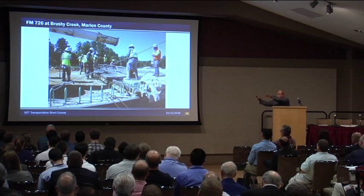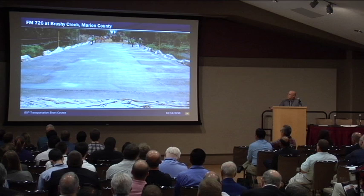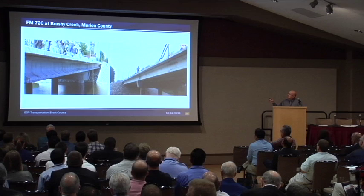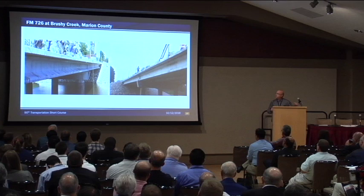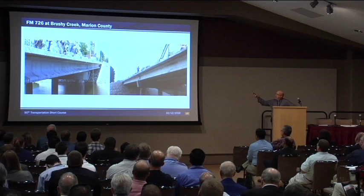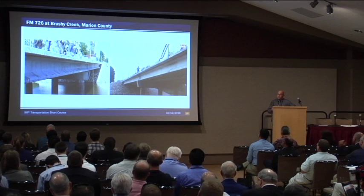This is the finish after the brush with the curing compound. As you can see, no leaks, no blowouts — the foam worked really well. We required pencil vibrators instead of the normal vibratory units to consolidate the concrete in that gap region and wherever that foam was being used as the dam. It worked great. No blowouts, even though we had issues with the adhesive.